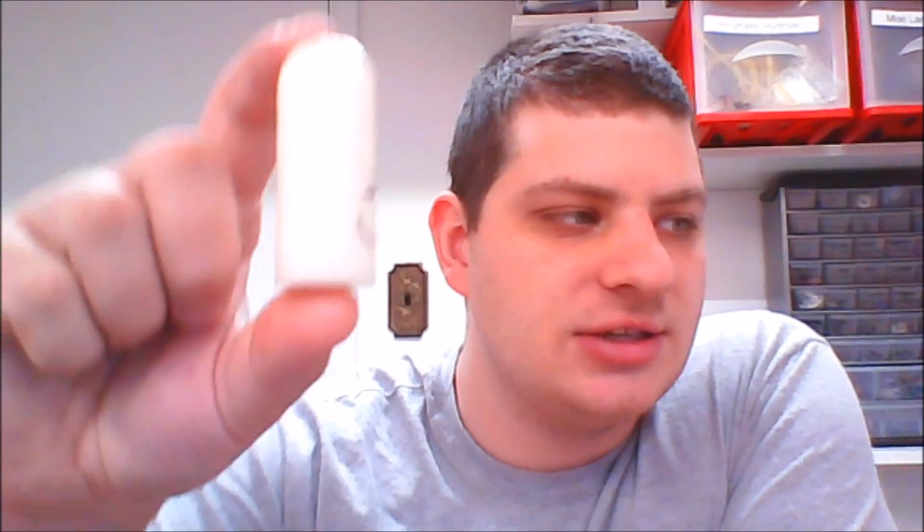You can see the nozzle I've been using to protect them. This one here was treated with cold vapor smoothing — the process from my cold vapor smoothing video, where I made a jar with a fan to help acetone vapor circulate. It was smoothed for half an hour and, as you can see, it is rather melty. I didn't focus hard on smoothing the inside, though I probably should have. I also printed the same tank in TPU — a material that is surprisingly flexible and has really good layer adhesion.